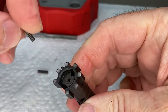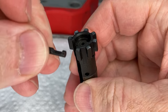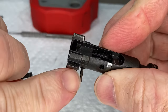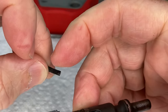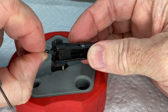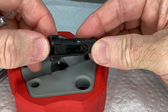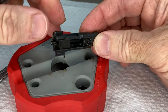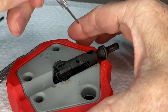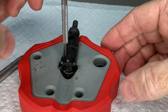Put your spring back in there. Now this plunger has a notch in it — when the notch is pressed in there, the pin is pushed in and it catches the notch to hold it in place. Put the plunger in with the notch facing the middle, just like that, and put this in with the pin pointing straight down so it fits in there just nice like that. I'm going to put this punch in the hole so the punch's own weight is going to kind of keep that heading downward.